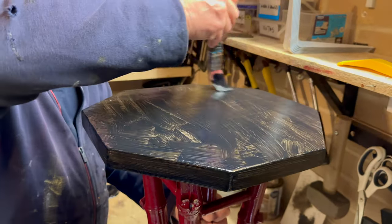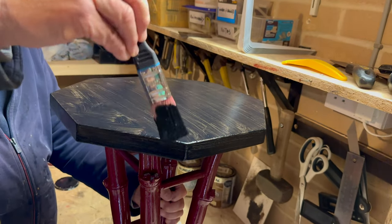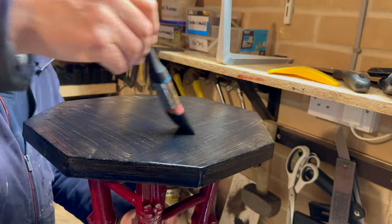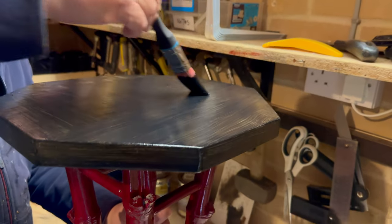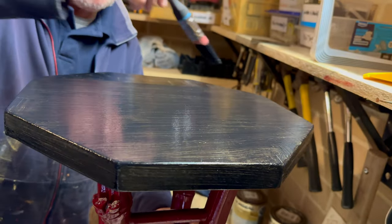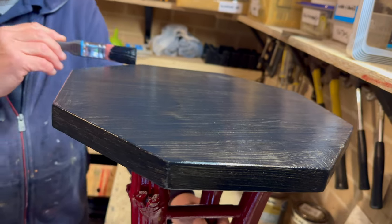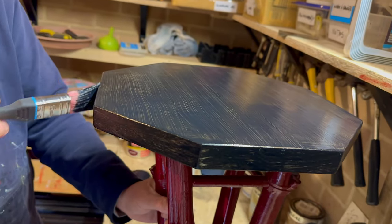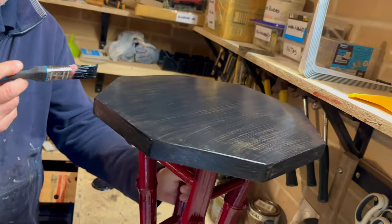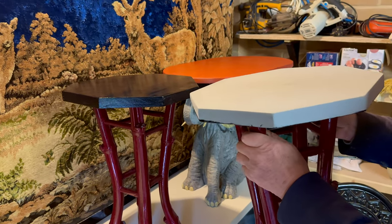Painting. First of all, you paint all the same. You pull the paint on, paint the same way, or brush the same way, and then you lay it off. Make sure the paint is not really high gloss. That makes it more even. This is only the first coat, so it's not looking for perfection. Brush off any paint on the sides, like this. Undercoat, two coats, top coat, one coat.